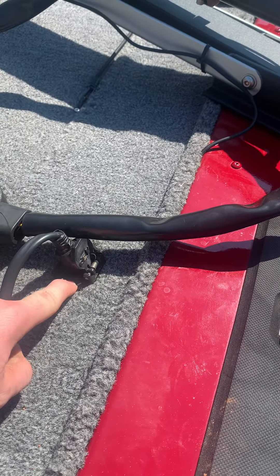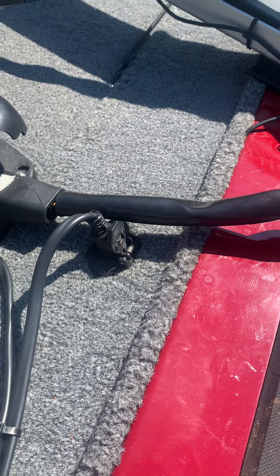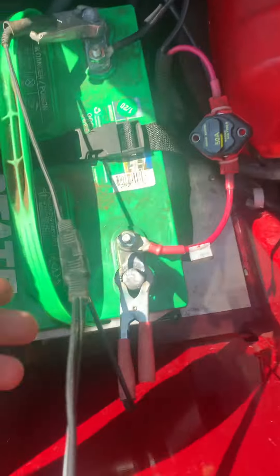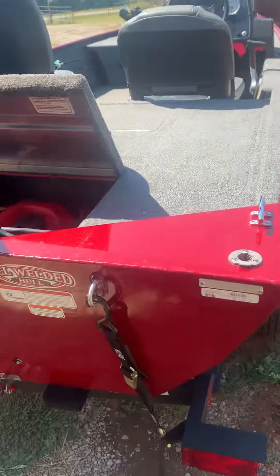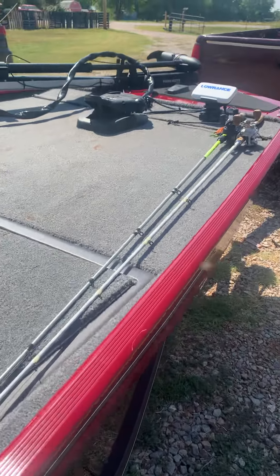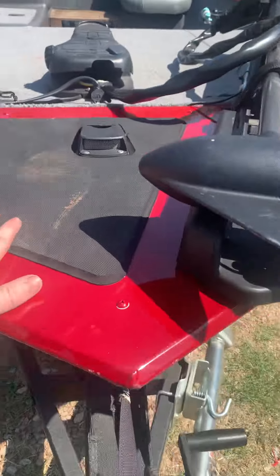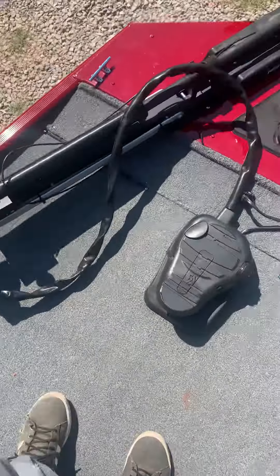I actually had to take this back all apart because my trolling motor wouldn't work. This plug has another connector — it's like a pigtail, probably 10 inches long — that plugs into the factory connector. The plug for me came undone and when it came undone the trolling motor wouldn't work anymore. It looks just like a battery tender connector. I was racking my brain — I thought I blew that fuse, checked it, checked everything, thought I ran a screw through the wire. But I pulled all that back apart and found that plug, and after I plugged it in it was working just fine. So I took a zip tie and zip tied the plug so I wouldn't have to worry about it again.